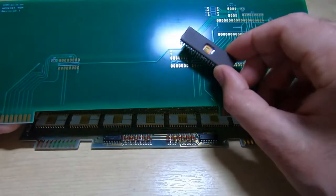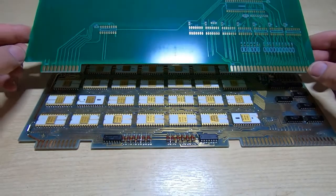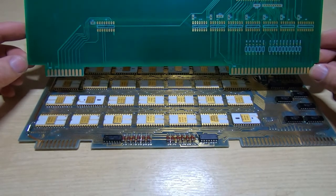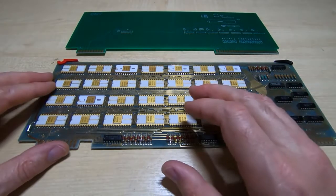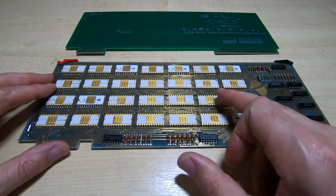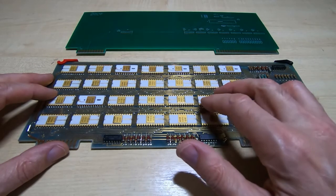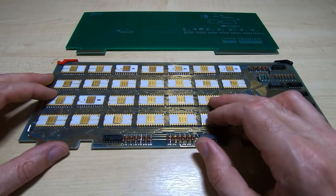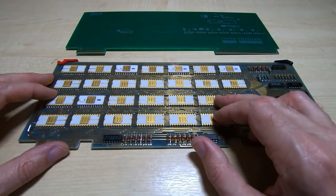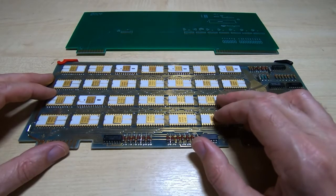This board is of course based around the EEPROM I've just shown. I may need to make a modification to this card — I didn't build it into the original design as I don't like making designs more complex than they need to be. Whether it's going to be required or not I'm not quite sure yet, but it's based around the fact that there are two Address 8 pins on each of the original ROMs. It's a very strange arrangement — effectively the ROM is like two smaller ROMs internally, with an Address 8 line going to each section. There's an Address 8 and a Not Address 8, so they are supposed to be mutually exclusive — one's high, one's low, and vice versa.